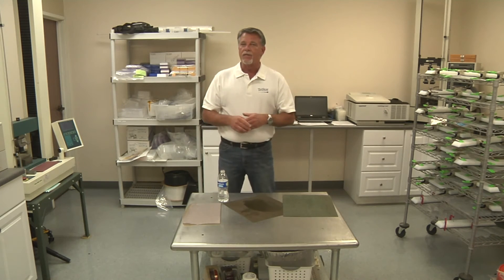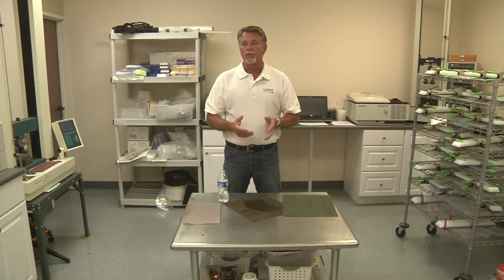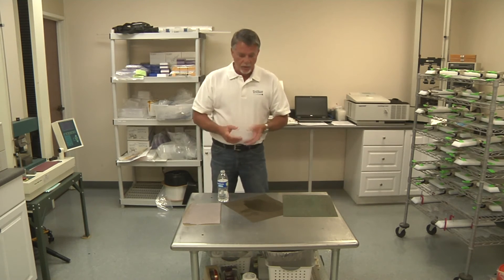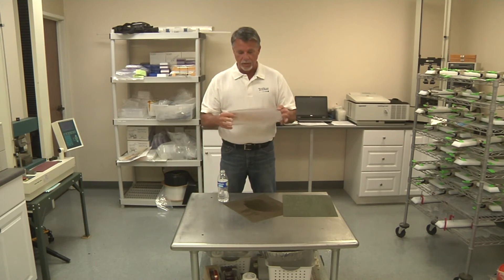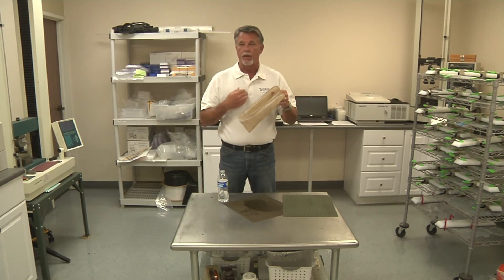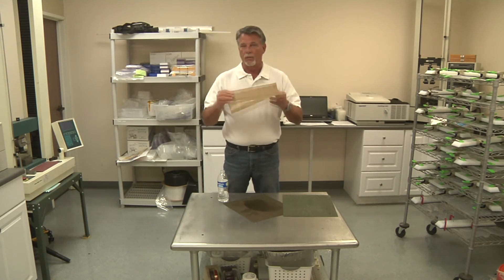The best way to check and see which side is bondable is especially useful if you have a piece of black material that's been etched and you don't know which side is the bonding side. The simplest way to do it is just with some water. This material here is an old, old piece of virgin Teflon. You can see that it's got a very marbled texture to it, and if I were doing the bonding I would probably not use this — not that it's necessarily bad, but it's obviously been sitting around for a long, long time. But it doesn't necessarily mean it doesn't work.